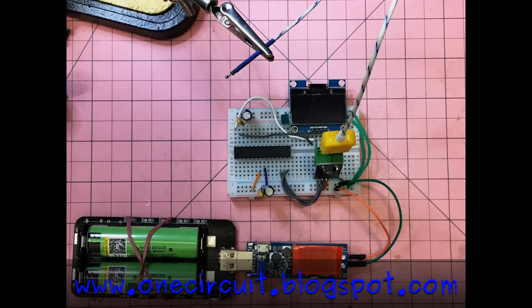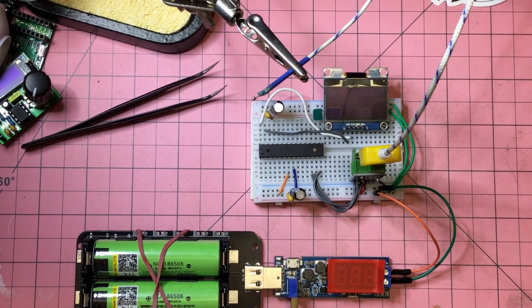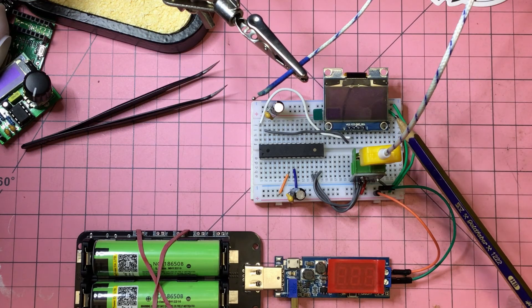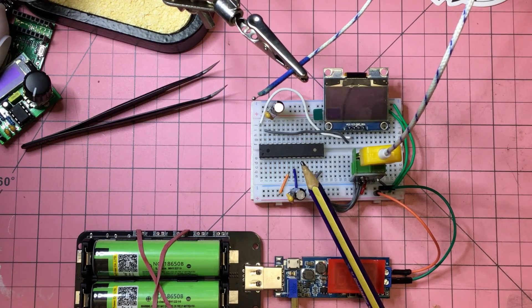Out with the four-digit seven-segment display and in with an OLED. There's some good news and some bad news with this project. The bad news: I swapped out the TM1637 four-digit seven-segment display because I wanted an OLED to show more data like time and temperature, and eventually to select temperature profiles or turn the oven on and off. But when I went to program the ATmega 8A with that code, it just overran in memory - there just wasn't enough memory.